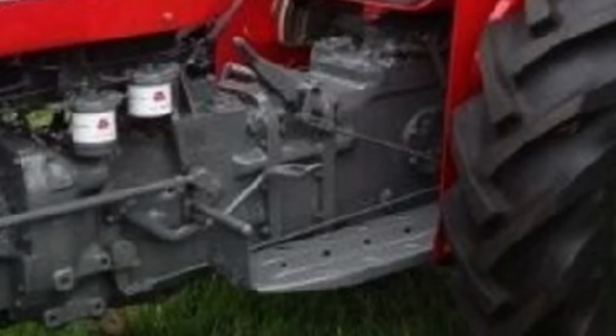Behind the gearbox on these super spec models, you had a cast steel spacer that made the tractor actually 6 inches longer in length, and this is a feature of the super spec range, so they all actually are longer than their equivalent. This extra length gave more stability when mounted implements or on the rear hydraulics. On some models there was also an option of a creeper gearbox, which was mounted within this casing space.